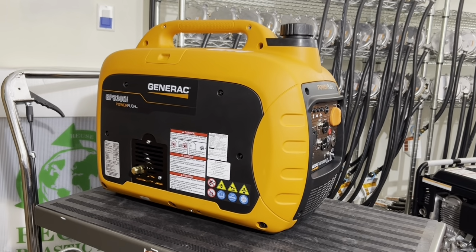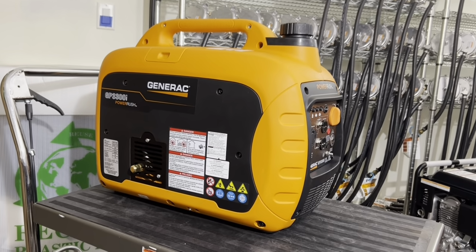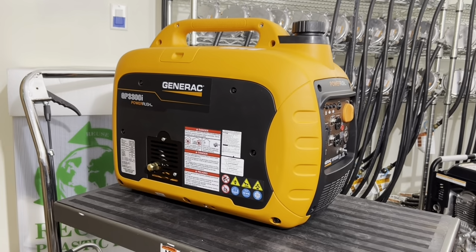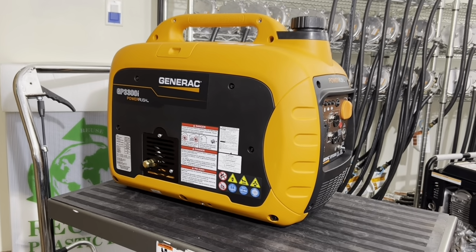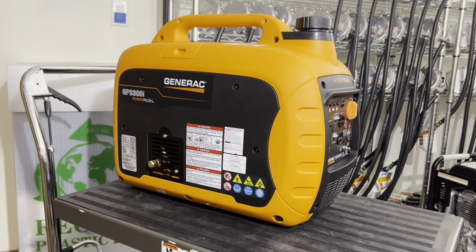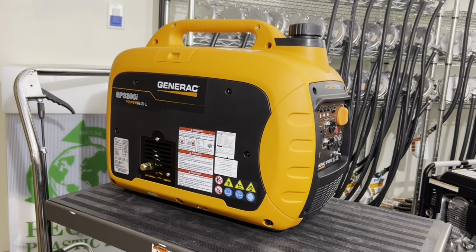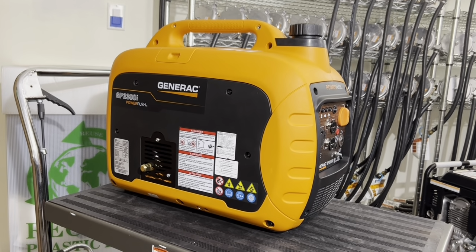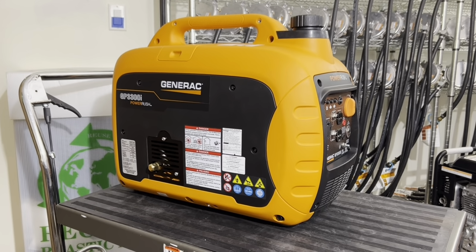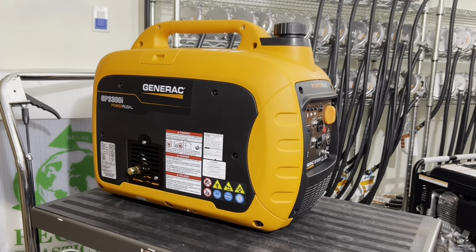First, obviously, as I explained, empty the gas tank and carb before starting on propane or natural gas, if it has ever run on gasoline. So be sure that the float bowl is empty, and it wouldn't hurt if the gas tank is empty as well. You don't want the two fuels mixing when you're using alternative fuels, or else you're going to get starting or running issues. So be sure that there's no residual gasoline left in the system when starting on propane or natural gas.